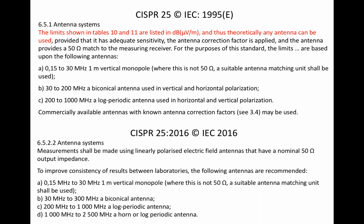Now, back in 1995, the fact that CISPR 25 got this wrong was neither here nor there to someone primarily working aerospace EMC. Not my turf, not my problem. Some of you may, in fact, be wondering as I speak where this aerospace guy gets off wandering onto your turf and casting aspersions. Well, the answer to that is what's coming up has spilled over from the automotive world into the wider world, including aerospace and military EMC, via SAE ARP-958, which is used by all disciplines making 1 meter antenna separation measurements, and which started out supporting military EMI testing.